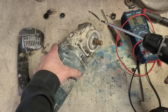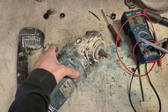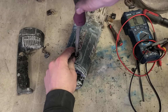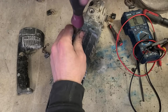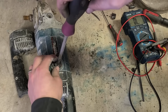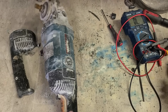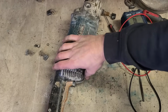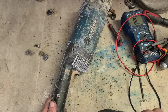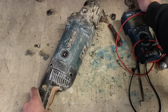Fixing that is getting onto the price of basically a small Makita 9-inch grinder. Just quickly stick her back together and get her out the door again. You get halfway through fixing that and find even more again. Or you get the whole thing fixed up and running and it could be sparking like mad. The armature could be on its way out. It's just not worth the risk, and it still wouldn't be worth the price now. So that is a no-go.